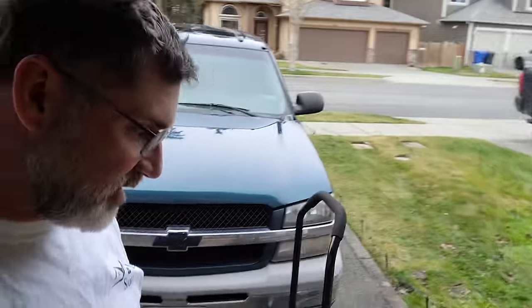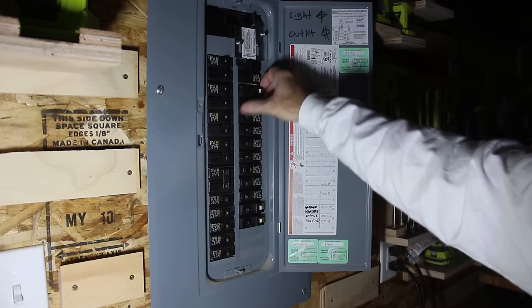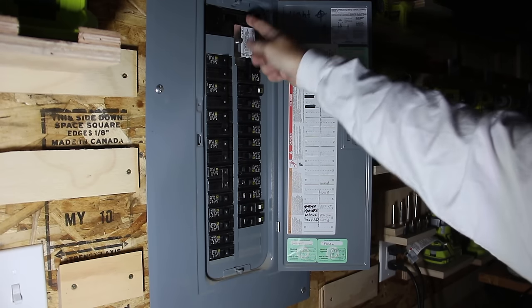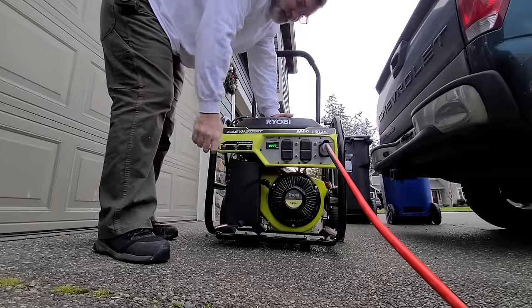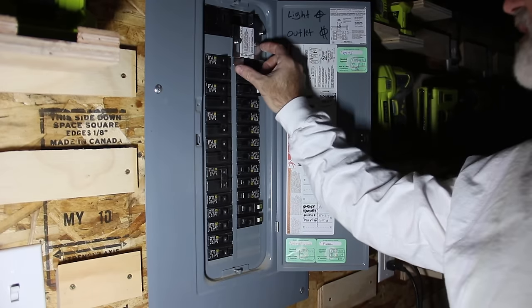It's go time. The wind's blowing, and if you made it this far in the video, you know what happens when the wind blows — power's out. It's out in my whole neighborhood. We've got the generator hooked up, cord's already running over to the receptacle. I'm going to set the power box up and start this generator and turn the house back on. Go ahead and turn off all the breakers in the house. Here's the generator, here's the main — let's go ahead and flip the main. I'm going to go turn on the generator next. Let's go ahead and switch on the generator input.